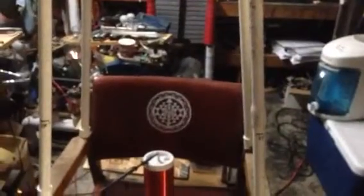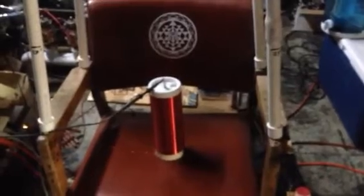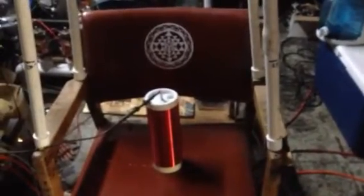Maybe the electrostatic field is being applied to this particular coil and then producing the resonant frequency naturally for the coil. Maybe that coil resonates naturally at 250 kilohertz, which would imply that whatever is in that space, this gap between the top and the bottom plate, would be getting its own characteristics amplified. And it's definitely AC. You can see the sine wave on the scope.